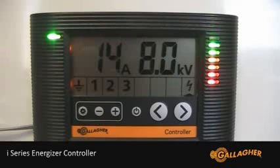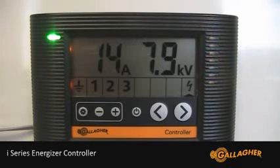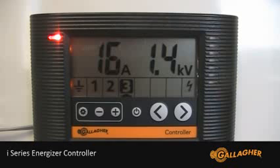If you look carefully below the Energizer icon, you will see the zone indicator. This indicator shows what zone information is currently displayed above in the voltage and current display areas. Using the scroll buttons, I can scroll left to view the information from zone 3. As you can see, I have created an imitation fault in that zone, so the voltage is below the alarm threshold.